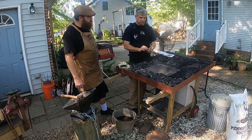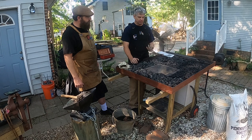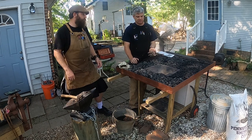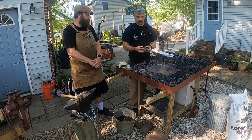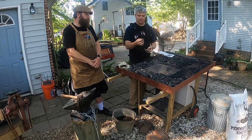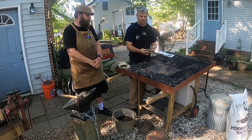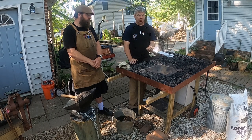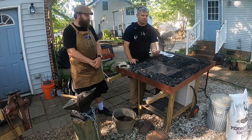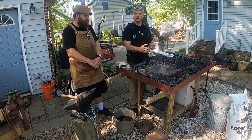A lot of the waste minerals, things that are part of this raw coal that will not actually combust, settle down into the bottom of your fire pot and form what are called clinkers. It's a hard, mineral, almost metallic substance. It makes a clink sound when you clink it against the metal. But this is like unburnt remnants or waste product, and that forms in the bottom there. And every now and again, we've got to fish that out to keep this open for good airflow.